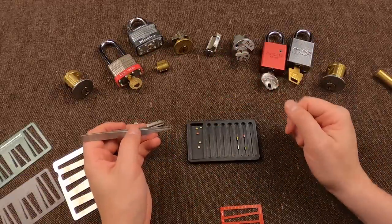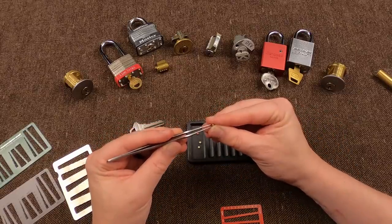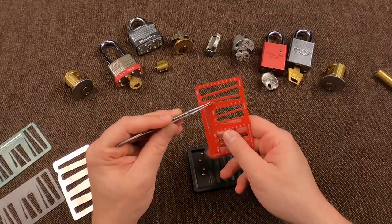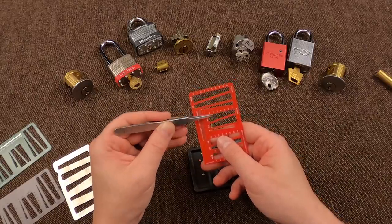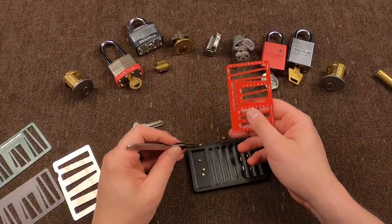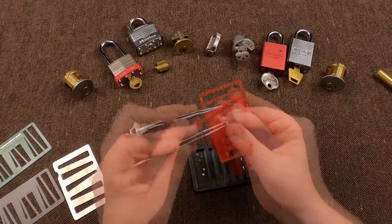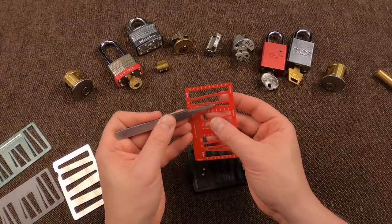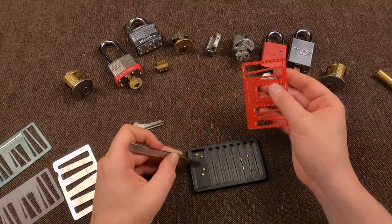Now, what about little tiny mastering pins? What if you have some of them? We just pulled these out of a different Schlage — can you decode those? Yeah, you can. Try it in the slot, work it over until it drops through. That was not a two — we're looking at Kwikset down here. That was a four because we're in the Schlage system. How about this green one? That fits through at a five. Red one, even taller — the red one can pass through at a seven. So there you go.